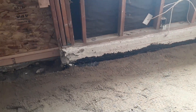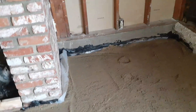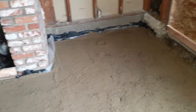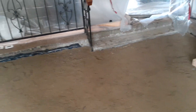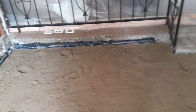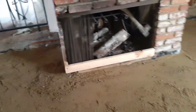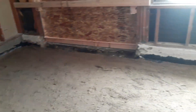We're going to put five and a half inches of pea gravel, which puts tons of pressure on that plastic at the corners. The sand and gravel raises it up enough so we don't waste or spend a lot of money on concrete, because it's not cheap. Also, when concrete dries, the water has to go both up and down for the concrete to cure. If you just pour it on top of another piece of concrete it won't work right. The gravel absorbs the water from the bottom, which allows it to dry quickly.